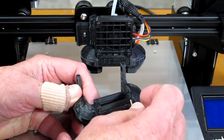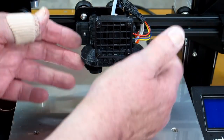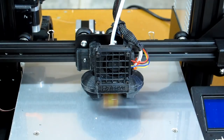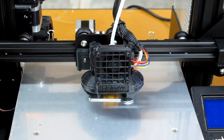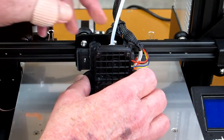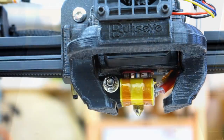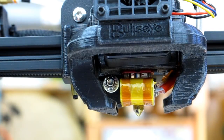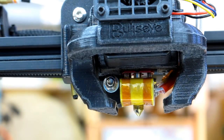A 2-56 screw threads right in there. You put the two screws in here to mount the pipe and leave it loose so it can slide up and down, then bring it all the way down until the cold nozzle is touching the build plate. Take the wrench that came with it and slide it underneath these two ears of duct work on the pipe, hold down on that, and tighten those two screws. That ensures the bottom of the pipe is the correct distance above the nozzle — make sure they're parallel to the plate so the pipe won't interfere with your print.